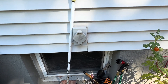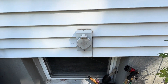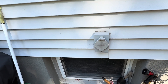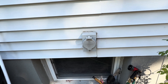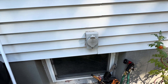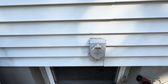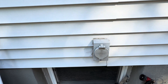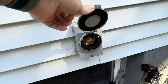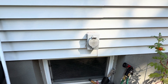We're over here on the side of the house. For a number of years we did not have a transfer switch, so when we had a power outage we just wheeled the generator out, started it up, and ran extension cords through the windows and doors — we powered the fridge, the lights, the television, whatever we needed, and that really was very sufficient. At some point I said, why don't we just install a transfer switch — it'll make it a little bit easier. This right here is your inlet for the generator; that giant plug plugs right into here, and it's wired all the way back to the circuit breaker panel. Let's go downstairs and take a look at that.